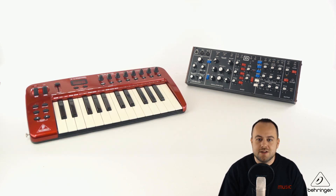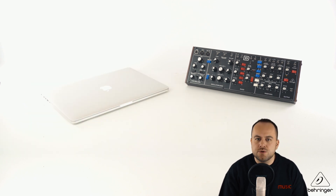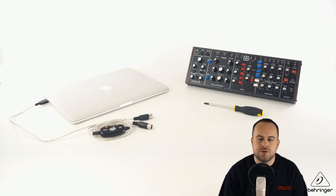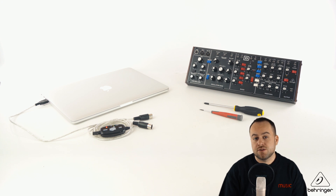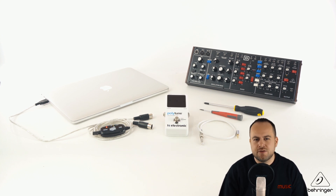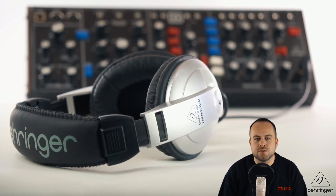You're going to want either a MIDI keyboard where you can play the notes directly, or you can use a DAW with a MIDI interface — obviously we're going to need a MIDI cable to connect these up. We're going to want a Phillips head screwdriver to unscrew the chassis. We also want a mini Phillips head screwdriver, which is insulated, so we can use this to turn the trim pots. And you want a patch cable and an optional tuner, along with some headphones or a speaker monitoring system of some sort.